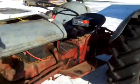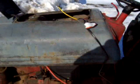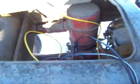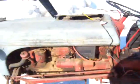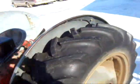I noticed when I was looking at the ignition system, when it didn't have any spark, that this is a positive ground system, which is a little odd. Usually cars nowadays are all negative ground, so I guess just keep that in mind when you're working on something. It might be a little bit different than what you're used to.